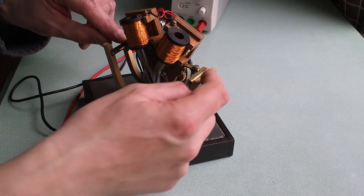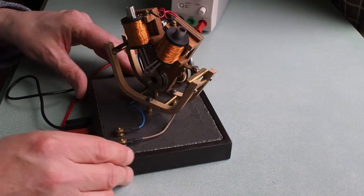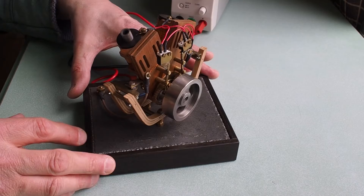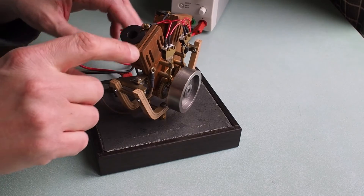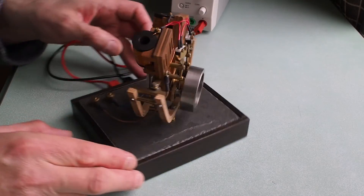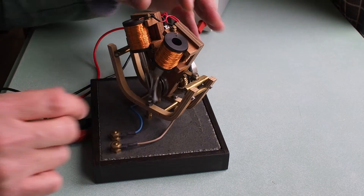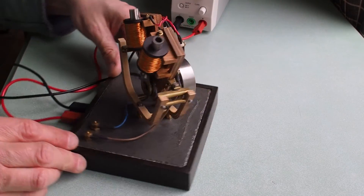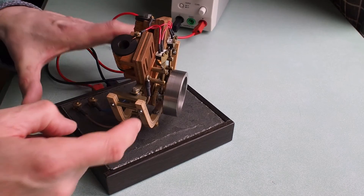The engine on this little cradle is mounted on two points, and it's isolated — there's a rubber bushing in there just to isolate it. It's meant to look a bit like the bottom of a motorbike frame that it could sit in. You'll see these are plywood laminations that make the main bulk of the structure for the V. That wooden structure sits around what is essentially a crankcase — a piece of tube that sits through the centre of the wood at the bottom, holding one bearing on the back and one on the front, with the gears being operated through an opening in that piece of tube.